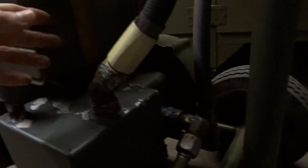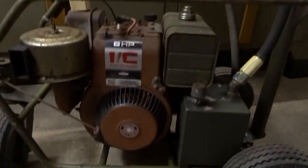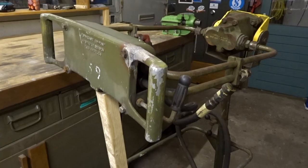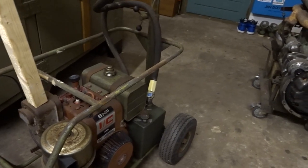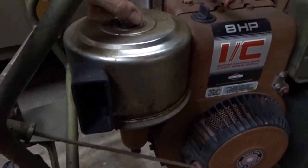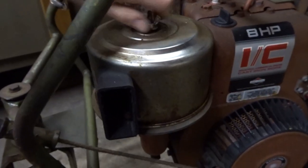This unit looks quite original and complete and more or less ready to go. But before I start or activate it, I want to make sure it's 100% good. So I'll clean the gas tank, check the engine oil, maybe refresh the hydraulic oil, and I'd like to see what's going on below the inlet cover — the engine inlet filter.